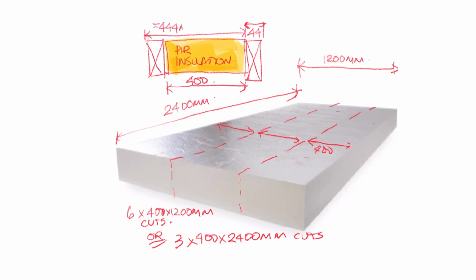You need to get your joists running at right angles to the frame, so we need to measure our centres down both sides and then use our speed square to draw a perpendicular line. Normally I'd use a carpenter's pencil for this, sharpened with my lovely Stanley knife. I love this one here, again I'll leave a link. Be careful with the marker, since its rounded thick tip will lose you a few millimetres of accuracy. A new Sharpie tip is okay, but pencil is always best. I'm using the Sharpie here to make it show up for the camera. Place a cross on the side where the joists will sit. No need to measure the thickness.